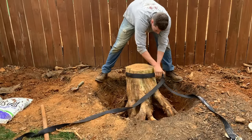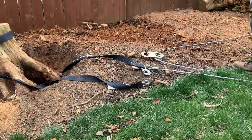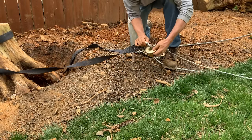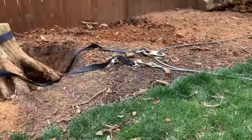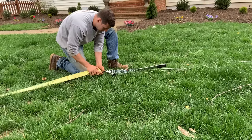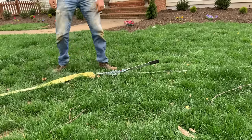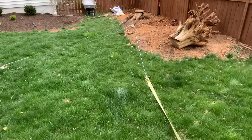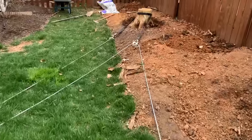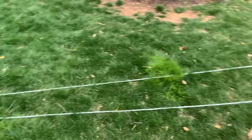And this strap will protect the wood on the stump from getting gouged by the cable. The winch connects to the strap around the second tree. Taking a look at my setup, I have a single line connected to one tree, going around the snatch block, back towards the winch, where I have a second snatch block, which finally connects back to the stump.